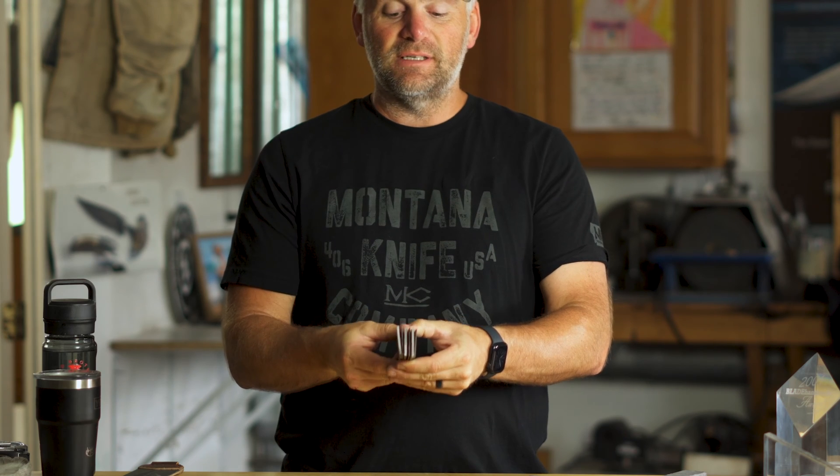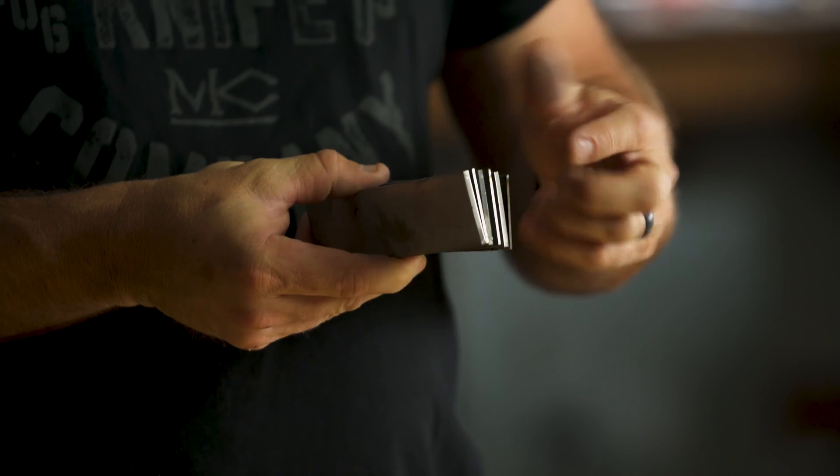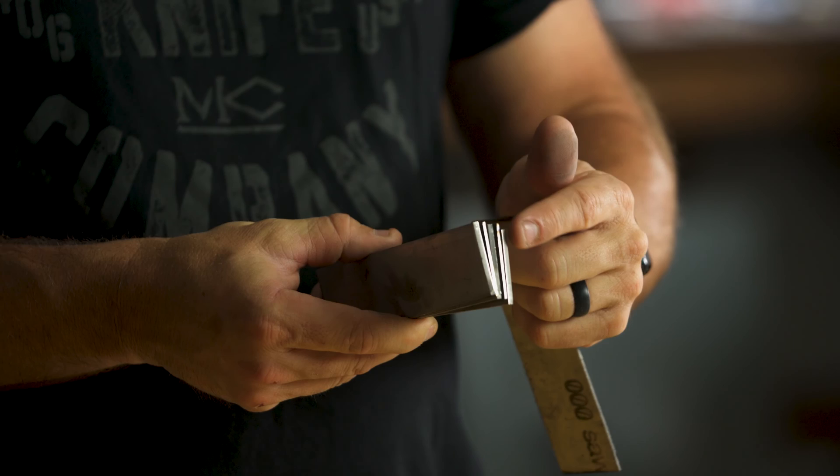When you get into a higher level of making Damascus, you may actually alter these layers — putting a bunch of layers of the same thing together, then one layer of a different kind of steel, then another bunch of layers — and what you end up with are different thicknesses of those layers in your blade. But for the sake of this simple explanation, you can see we have different layers of steel mixed throughout, and in this example the 15N20 is very thin while the 1080 is a little bit thicker.